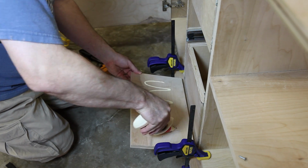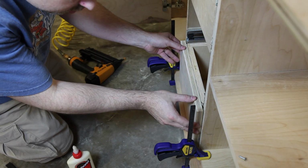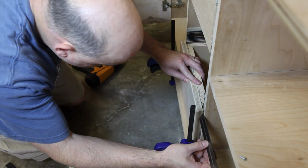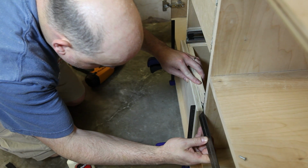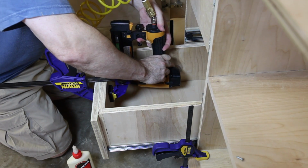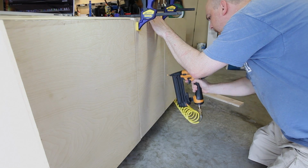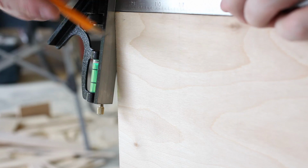We'll want our drawers to have matching faces, so cut and glue faces to each drawer that slightly overlap the sides by approximately 1/4 inch. Once your alignment is good, clamp it in place and use brad nails from the backside to secure it. Follow this up with a solid board covering the back side of the drawers.